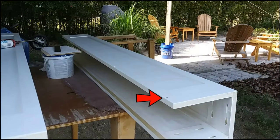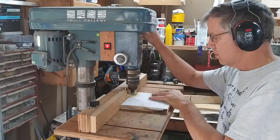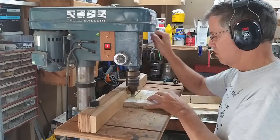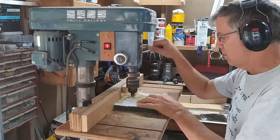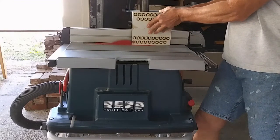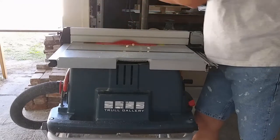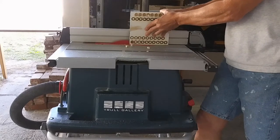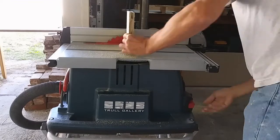I had pre-drilled the holes to attach the sides of the columns to the backs — that included a three-eighths-inch diameter recess about a quarter of an inch deep. To fill those holes after installation, I put a three-eighths-inch plug cutter in my drill press and carefully cut the plugs I needed. I'd need about 24 plugs, so I drilled about 35 — some will be damaged, some will get lost, and some extra never hurts. I set up my table saw with the blade just high enough to cut through the first set of plugs, with the fence set so there was just about a quarter of an inch of stock to the outside of the blade. As I made the pass, the plugs were cut free at the correct thickness. They went everywhere, which is part of the reason I cut extra. I raised the blade height and repeated the cuts for the remainder of the plugs.